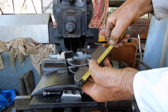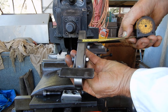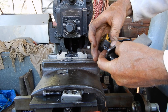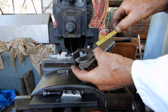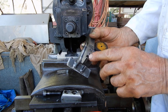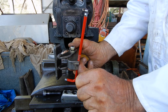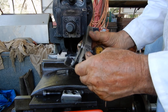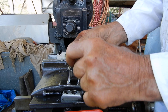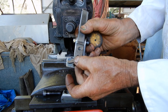It's about 150 millimeters long, 35 millimeters by about 20. You could probably make it a bit narrower if your T-slot is smaller. It's about 80 millimeters down from there to there. I've cut this on an angle to give the tool some positive rake, and I've also ground the tool tapered so that it wedges itself into there when it's clamped.